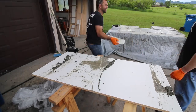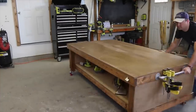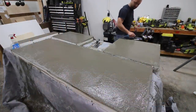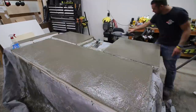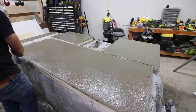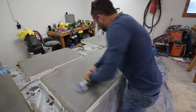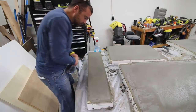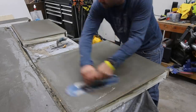We put all the molds back on the table and rolled it back into the shop. This large rolling work surface is great for concrete projects because of its size and portability — if you're interested you can find the rolling workbench video and plans in the description. A lot of people do one troweling and then cover with plastic to let it dry, but I like to practice my hard troweling skills and prefer the underside to be very smooth, so I'll trowel it two or three times at various consistencies. I let the concrete set up over the next few hours, and when it barely leaves an imprint from my finger, I'll do the final troweling. The hard troweling technique gives it a smooth, good-looking finish. Once they set up a bit more, cover the slabs with a sheet of plastic to help them cure evenly.